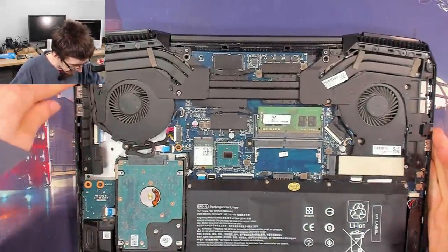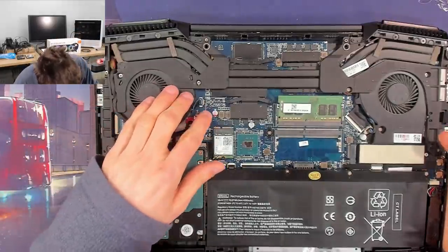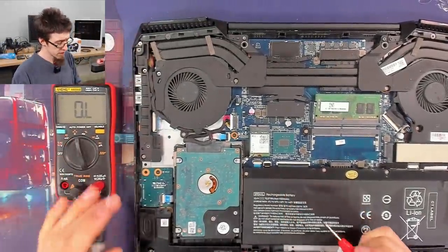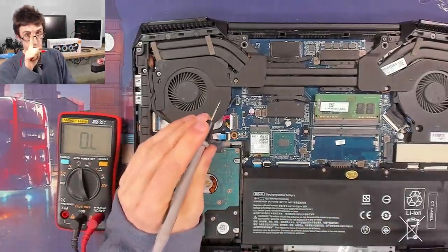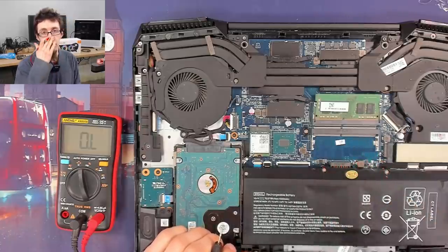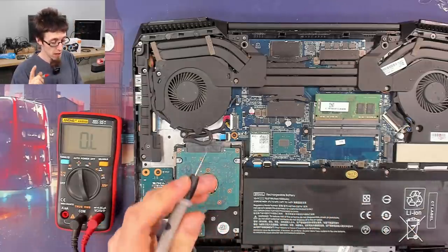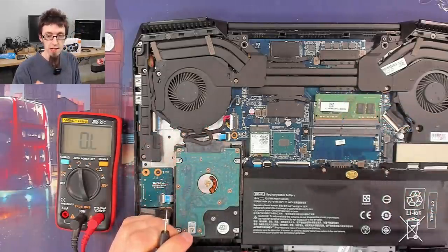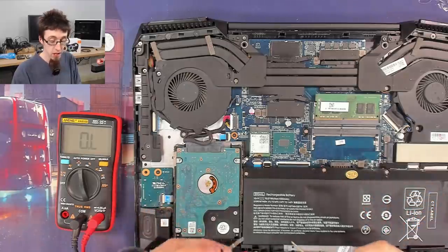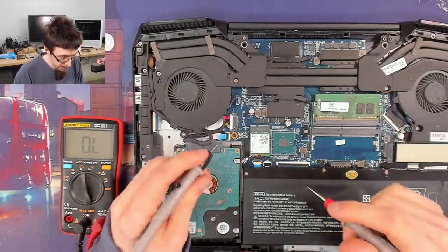The DC jack is over here and comes in here. Is that a mark I can see on the reverse protection diode? I'm not going to be that lucky, am I? Let's get the multimeter. I'll put it in continuity mode so it beeps when I touch the probes. Be aware: continuity mode will beep at anything below around 30 ohms, so it will beep on low impedance. Five ohms, for example, is not a direct short - that's why your CPU always looks shorted to ground in continuity mode. We'll use beep mode for now just to do some basic checks.